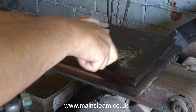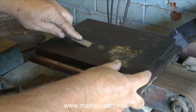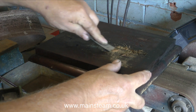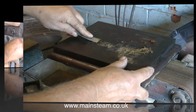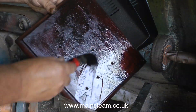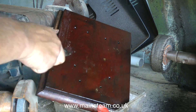Turning my attention to the base now, I'm using the ruler dry to just remove some of the material to see what it's coated in and it looks like French polish. Sometimes mounting bases are not what they seem — they may look like mahogany, but when you start scraping at them it turns out to be soft wood that's just painted. This example is a proper piece of hardwood and the lacquer's coming off quite well. I'm now going to leave the main base for a while for the cellulose thinners to soak in.